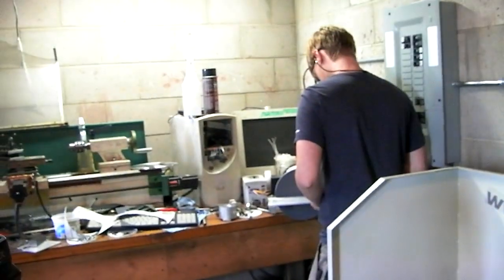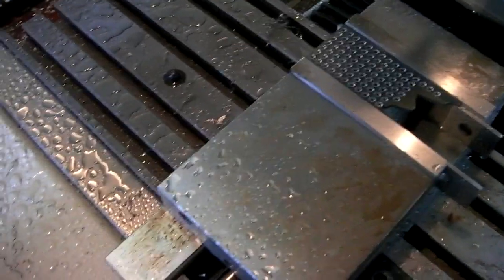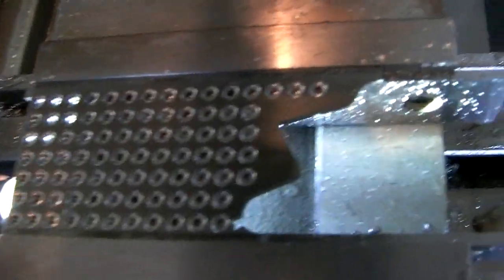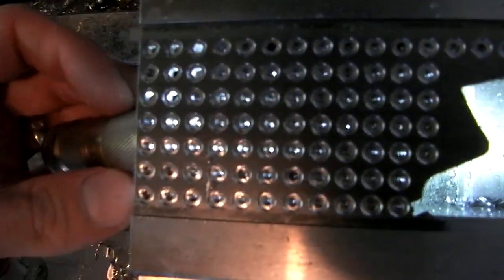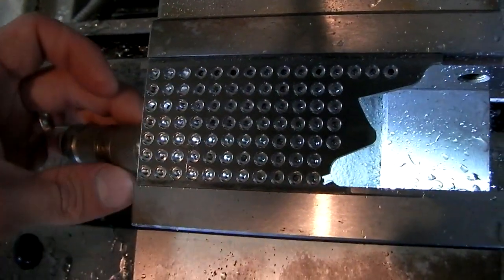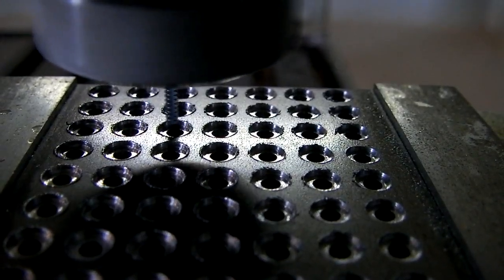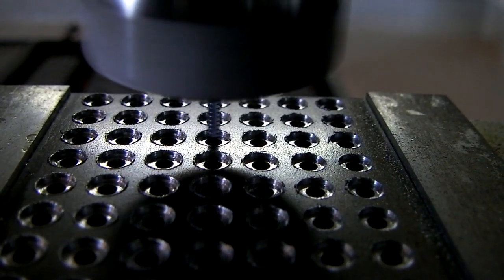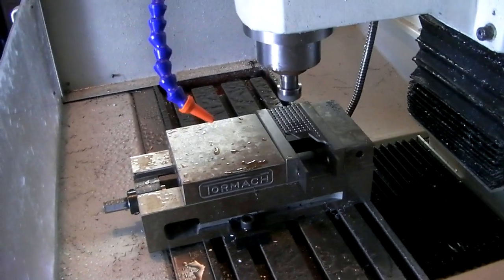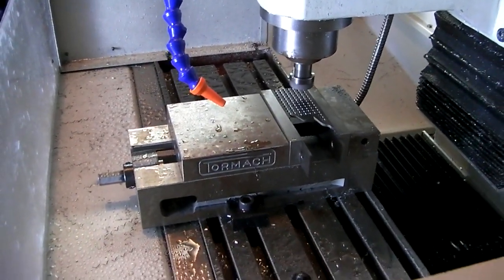All right, let's go. Looking through the holes I can see that not all of them drilled all the way through, so before thread milling I want to make sure all the holes go all the way through — and they didn't. You can see which ones did and which ones didn't, so I'm going to do the drilling operation again, quite a bit deeper, just to make sure they go all the way through. Right now I'm doing my air cutting so I can verify that the code works and that it's not going to break a tool and cost me a lot of money — but it looks like it's working really good, so I think I can trust it.